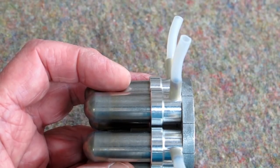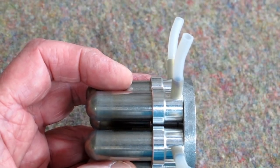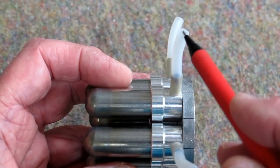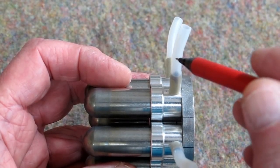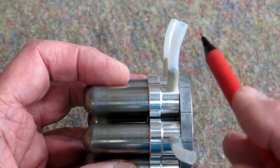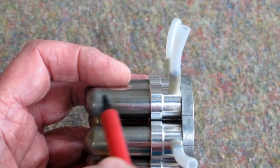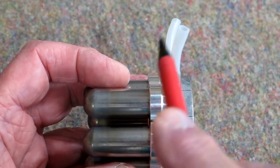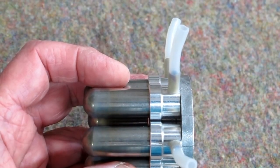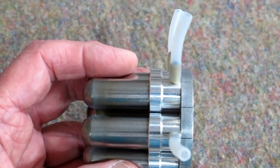The piston pushes through the connecting rod to the crankshaft and causes the engine to rotate. When the piston gets to the bottom of its travel it starts upward, pushing air back in this direction through this tube. The power of the piston is from the momentum of the spinning engine. At that point the pressure here is a little bit higher than the pressure here, and the displacer is moving in this direction, helping distribute slightly cooler air back to the hot end to be reheated. Each cylinder in turn — that process just repeats itself and the engine keeps running.